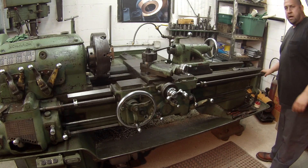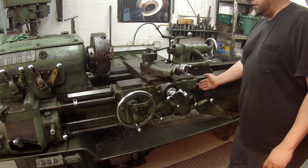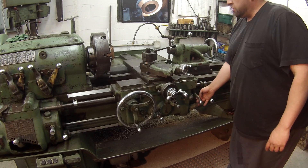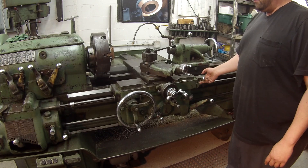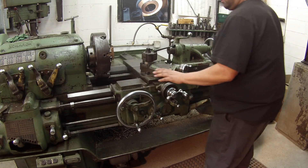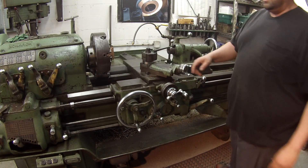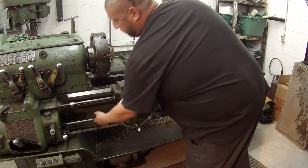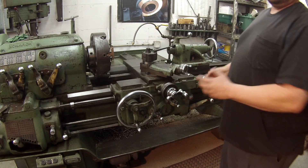You've got a housing down here holding it. There's a lever on mine, and I believe they're all equipped with one. So if you pull that lever, that rod moves and it turns, and it changes the direction of feed — whether it be for your lead screw or your feed rod, that's what changes the direction there.